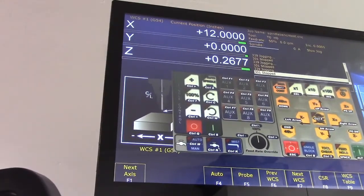We're right on zero. Take a look at our display — we hit the mark. That's how you do the fine tuning of your machine steps per inch. The X-axis is complete. I'll set up my Y-axis and do the same process to see how close the numbers are — the screws and pulleys on X and Y are the same.